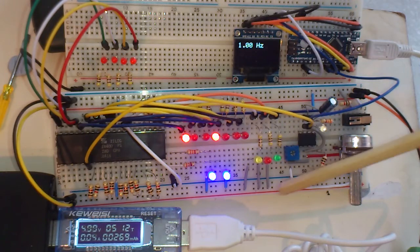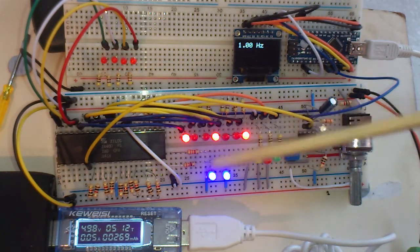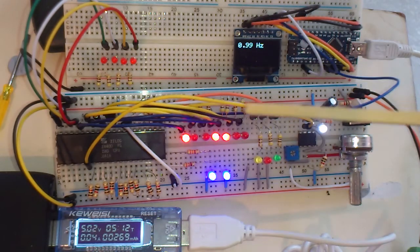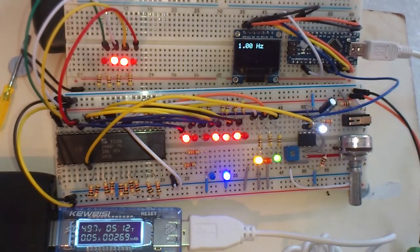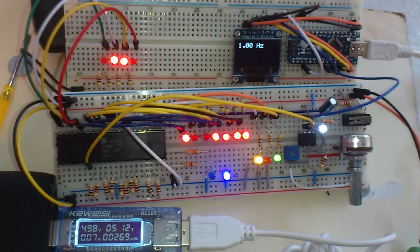Now you might say, why use 2 clock cycles just to do fetch from dynamic RAM? Isn't that a bit of a waste? Other processors didn't do that. They would use an external mechanism, but it's not actually wasting any clock cycles, because the Z80 uses those 2 clock cycles to internally decode the opcode. It's just fetched, so it has to use those 2 clock cycles anyway, and it just happens to do something extra at the same time.